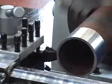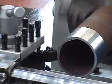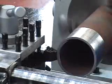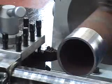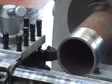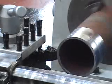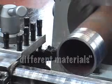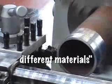I'm going to take one final cut just to remove the last bit of rust, and Keaton has brought some oil — I'm just going to put a couple of drops on here. It should improve the surface finish. You can hear a difference; the lubrication is improving the finish, which is good because we're running bearings on here afterwards.